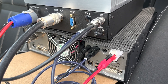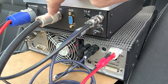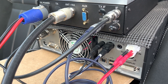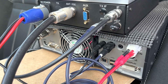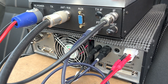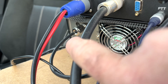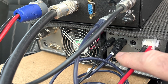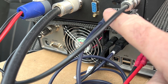So this is the sharp end. We've got the antenna coming in from the SWR meter, power to the transverter. Depending on how you get it configured at manufacture, you can have separate TX - here I've got combined TX and RX. You can have an IF out; this is the IF from the rig, so this BNC short patch lead goes into the FTDX10. I've got a PTT connection that grounds when the rig keys, and that keys the transverter.